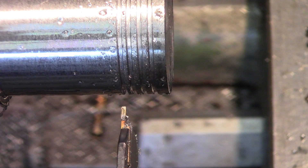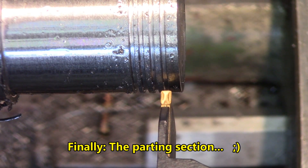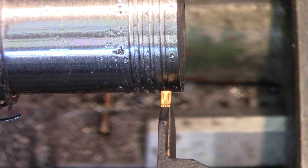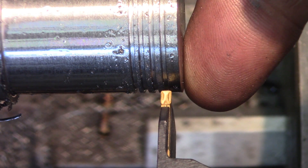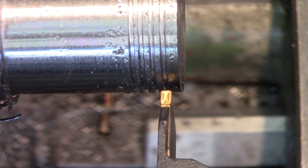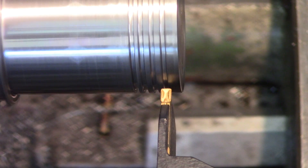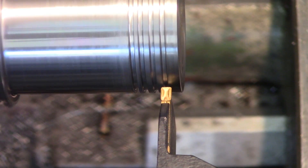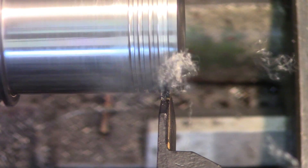Let's try the original insert in there, just to see if the tool is meant for that after all. Let's see how this performs. This is the original 2mm insert, untouched — it's a brand new insert. We're cutting this billet, which is about 27 millimeters diameter, a little bit over an inch. Let's see how it does at 650 RPMs. I'm going to try to get the groove and we'll start from that groove.